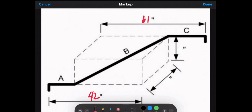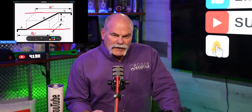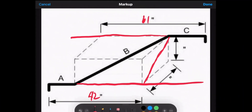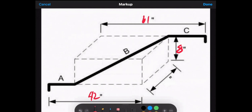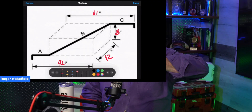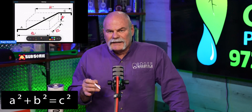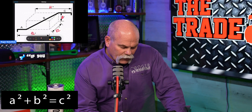If section A pipe were running right straight through, that's what it would do. If C pipe were running right straight through, that's what it would do. Now if we were doing just a straight center-to-center measurement you could literally measure right straight across and know what it is. But we're figuring this a different way — we're going to take an 8 inch rise and a 12 inch horizontal. We've got 8 inches on the vertical, 12 inches on the horizontal, and we're going to square those. The formula is a squared plus b squared equals c squared.